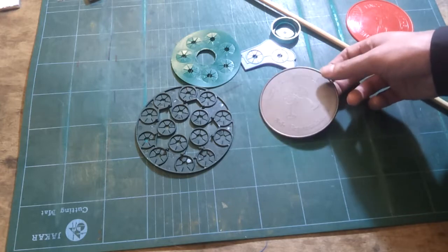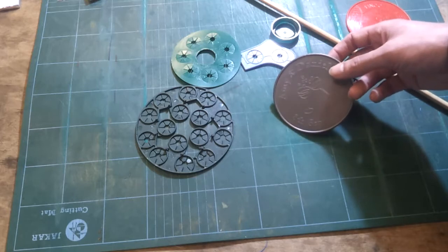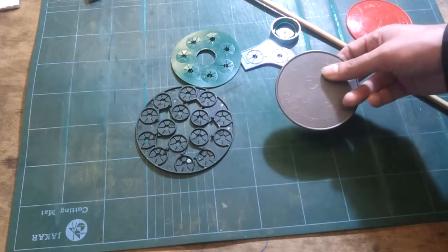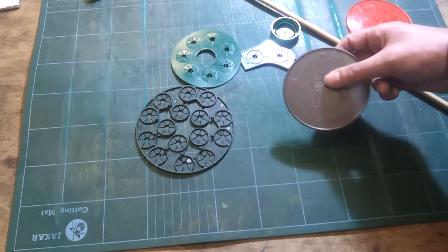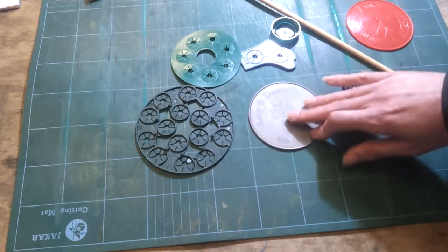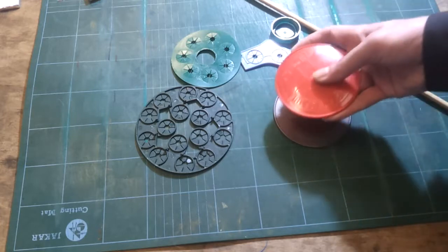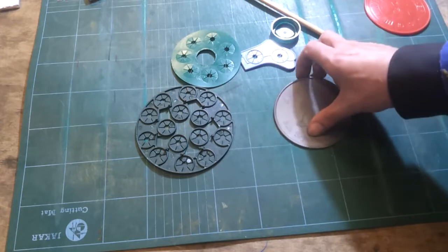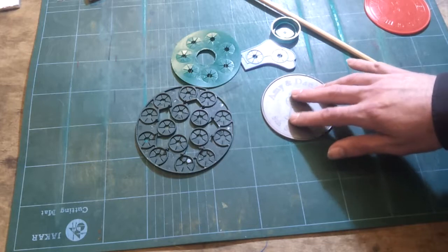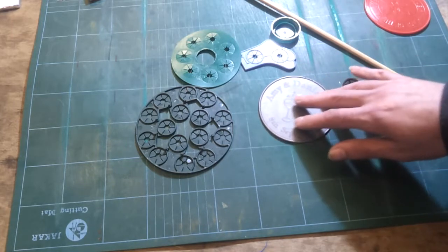It's actually a material called Sequel, which is mostly used in the automotive trade for producing bumpers and trim panels and things like this, and it's got pretty good impact resistance and low temperature resistance as well, which is obviously what you need for car paneling. So I've used this a few times in the past. It's nice and easy to mould. It doesn't suffer from the shrinkage problems that you get with pure polyolefins, and also this is UV stabilised because obviously it's intended for long-term outdoor use on cars and so on.